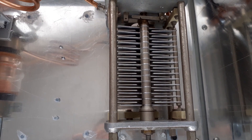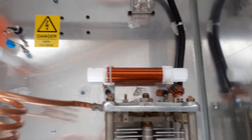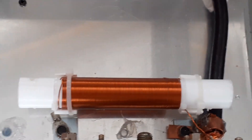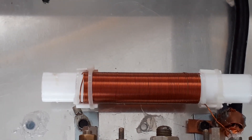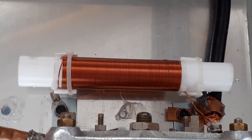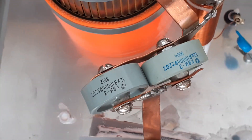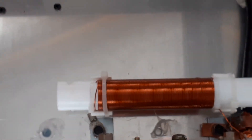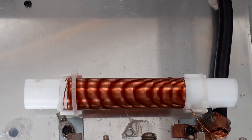It works well, fully meshed for 10m. I did try adding extra turns on the tank coil but it didn't really make much difference — I suppose I could add a padding capacitor. At the bottom is another 50 to 55 microhenry choke. This one's a safety choke — if these capacitors break down and DC voltage leaks through, this should short it to ground and blow the main fuses. It's a safety feature.